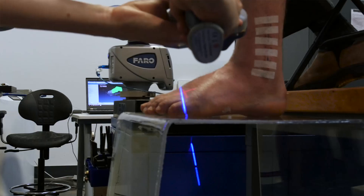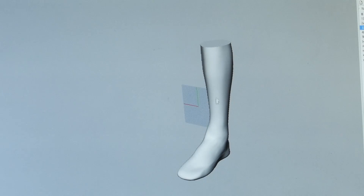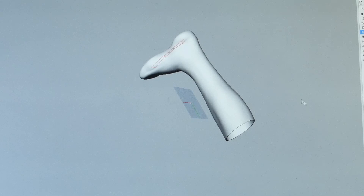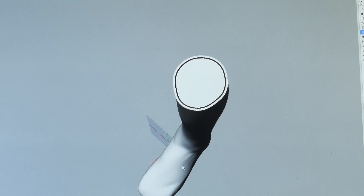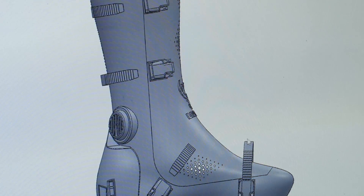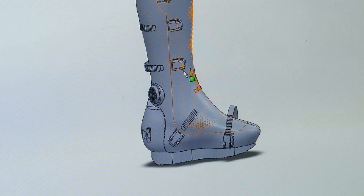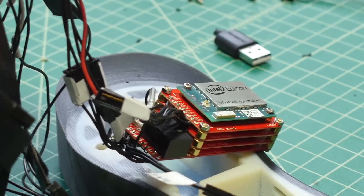To begin with, we took a scan of Mike's leg using a faro arm, and we got an STL mesh from that. And then those curves became this solid model of Mike's leg. That model was used to build the cast, which is basically an offset of that solid model. We brought it into SolidWorks, where we added the split line that separates the two bodies of the cast, the ratchet straps, and in the sole we have all of the components fitting in nicely.